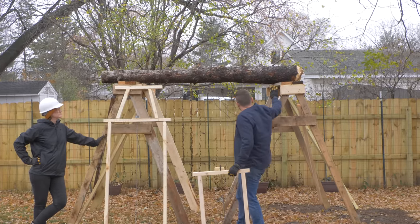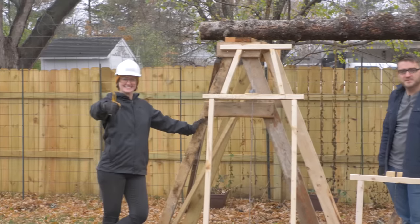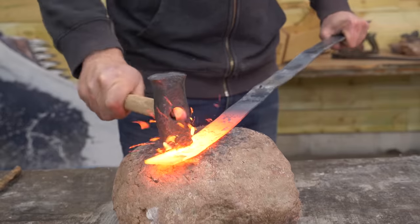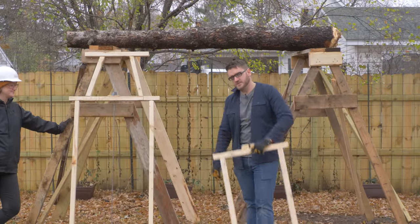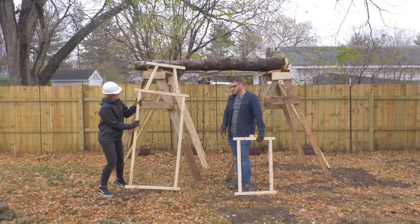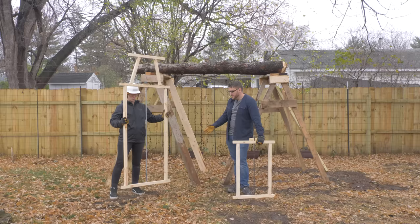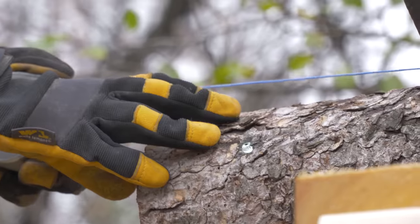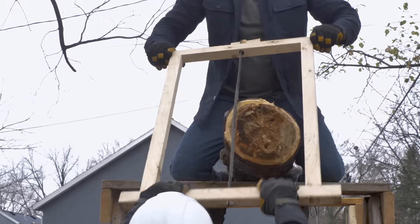The historical way to mill a log into lumber uses either a pit or a pair of giant sawhorses, allowing a two-person crew to run the saw from above and below, slowly working down the length of the log. We have our log up on giant sawhorses that Lauren put together to avoid digging a pit. We forged a saw blade for a sawmill but we're first using it for actual hand milling — it's a little short, so I made a much bigger one more appropriate for a two-person team. First up, we put a chalk line to get a straight line to cut along, which will be the bottom reference to square everything off.